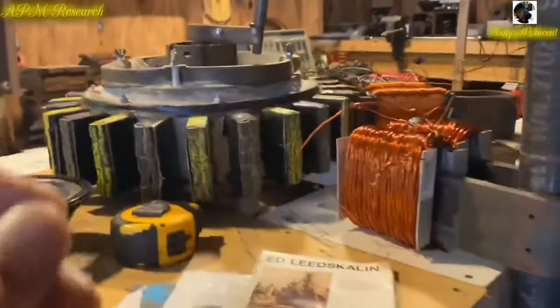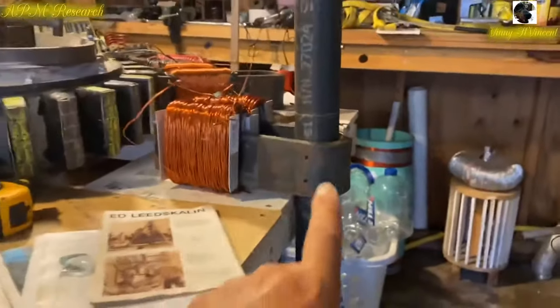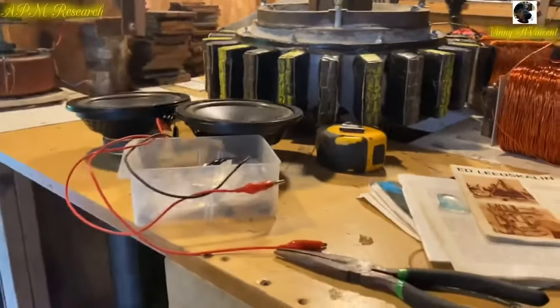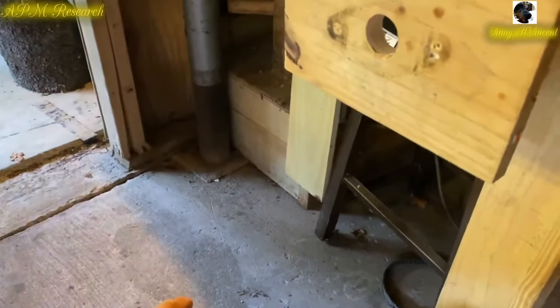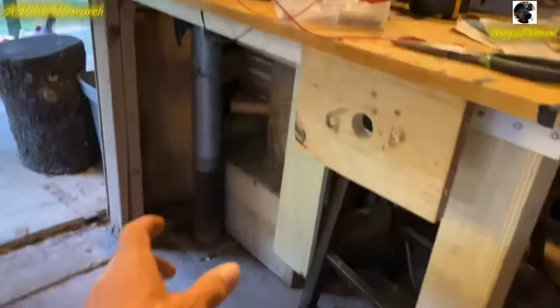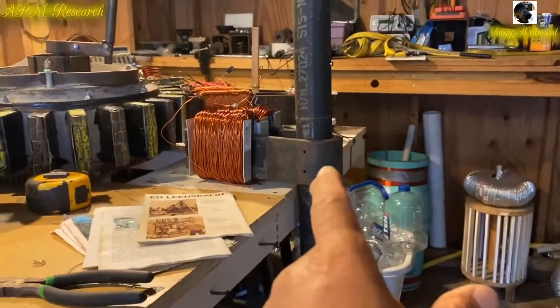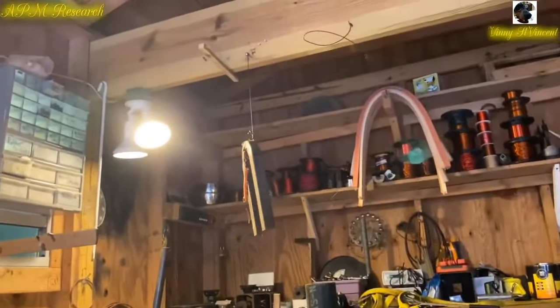So this is exactly the video that we're going to get into, where we take this pole and move it over to this side, and we're going to take an 8-foot grounding rod, which is iron in the middle and copper on the outside, drill a hole and drive it in the ground, and then it'll be attached to this pipe, which will be sitting there. You'll see the PMH will follow Ed's specifications. We'll use these PMHs, but we could use this because this fits, and this fits perfectly to this as well. These are just stretched out longer. I don't think it really matters.